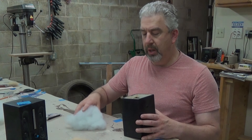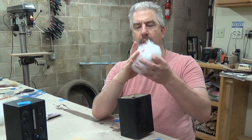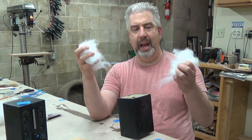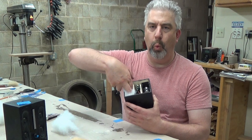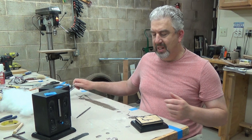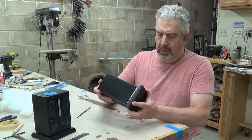Once the amp was installed and tested, I was ready to close up the cabinet. I filled each speaker cavity with a small wad of pillow stuffing — you can get it at the craft store, most Walmarts, or Parts Express, or just steal some from an old pillow. I used about a grapefruit- or softball-sized amount, split in two and loosely stuffed into each speaker cavity. That just cuts down on echoes bouncing around inside and making their way through the speaker cone. To secure the base to the cabinet I used a little of the same black silicone sealant — no screws, but if your base-to-cabinet fit is loose, I'd recommend at least one or two screws through the bottom.